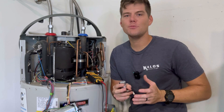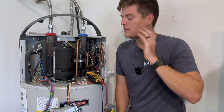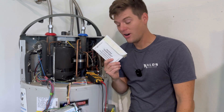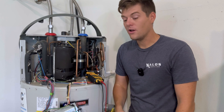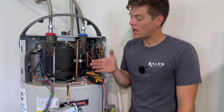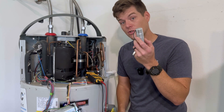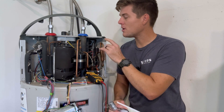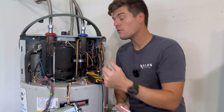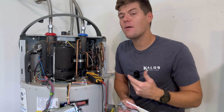The reason I made this video is to show you that just because you don't know anything about something you've never troubleshot before doesn't mean you can't figure it out. What are the steps? Get your technicians-only service manual. Understand the model you're working on. Find the error code, find out how to read exactly what's wrong with the system, and then take a systematic approach checking those components. If my compressor won't start, there are two things I'm going to check: the capacitor — which is designed to start the compressor — and the compressor itself to make sure it's not grounded and doesn't have open windings. Maybe the thermal overload has tripped, or maybe there's a refrigerant leak causing that switch to break the circuit. It could be a number of things.